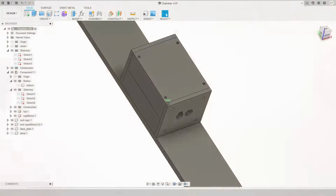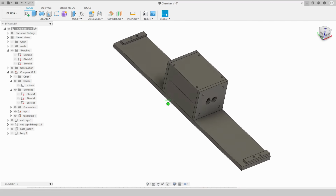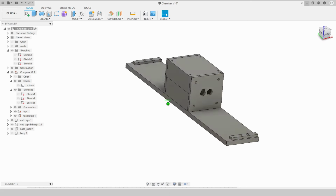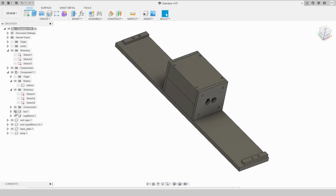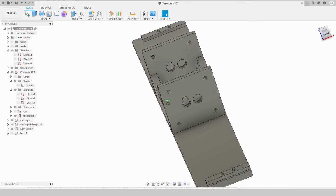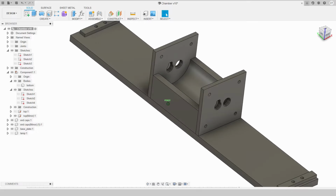And I should be able to actually see the transverse mode, something we'll get into in the next laser video, on the sheet. I got the low power version, so hopefully if I'm getting some lasing, I should now be able to see it. So that's my attack plan moving forward. A new, higher quality, and hopefully shorter flash tube, higher energy with lower capacitance, mirror mounts turned around the right way, and some more legit kit to test the output. When I get evidence of lasing, I can start to mess around with maximizing the output power and things like that. But hey, one step at a time.